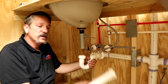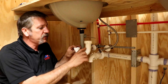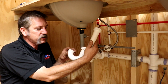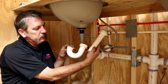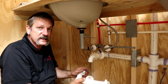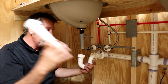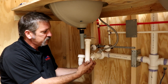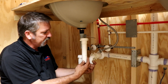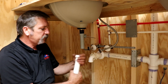Our standards keep us down a little bit lower, which requires this tailpiece extension. On this p-trap there's a socket and you want the tailpiece to fit all the way down in that socket. It can float in there, but it's better if it goes all the way down because that ensures a better seal and it's less likely to leak. Put that up on there, get out your extension — it's going to be a lot longer — and eyeball where you want to cut it so it sits in that socket.